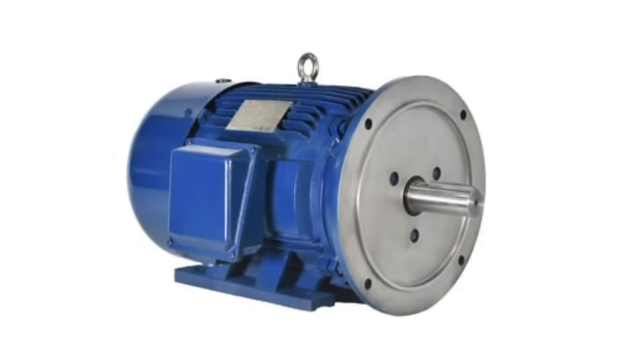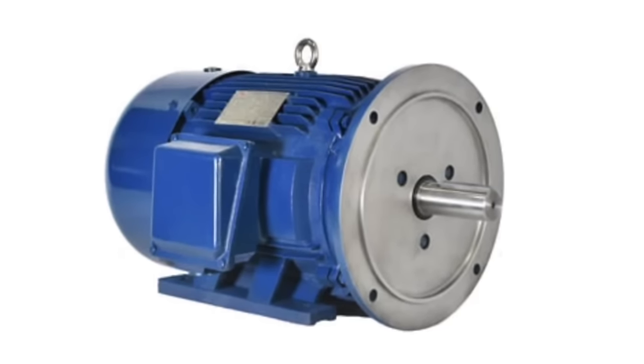On the opposite side of that, there is a hydraulic power control unit. The whole ride, all the motion on the ride, is done by hydraulics. So the hydraulic power unit is pretty much two, three big components on side of there. The first one is the AC motor. It is a delta Y motor, a delta Y start. It uses two different types of starters to get that motor up to speed.